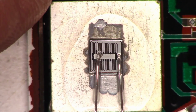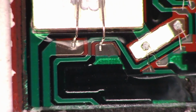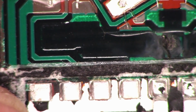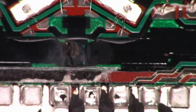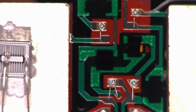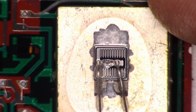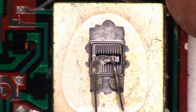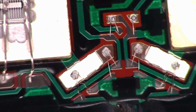All right, a little bit of bonus footage right here. Here is the inside of the STK power pack. So I pried it open. Some of the pins became detached. You can see some of them are still there. But you can see the driver transistors in here. There's the output transistor, the one that grenaded itself. There's some of the lower current drivers.